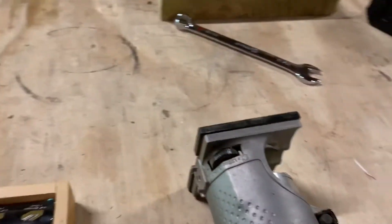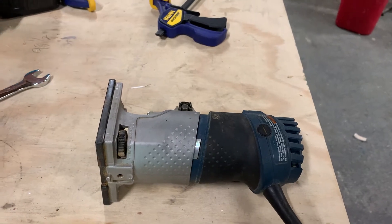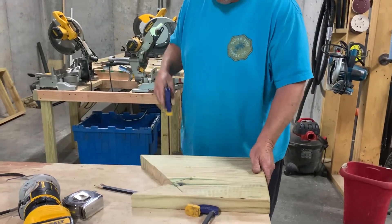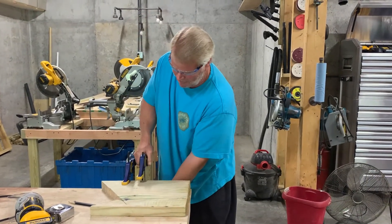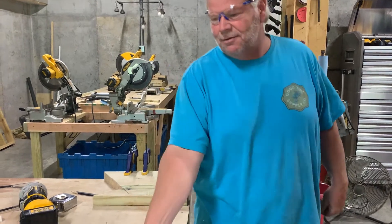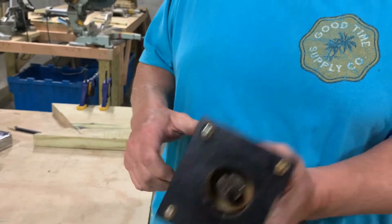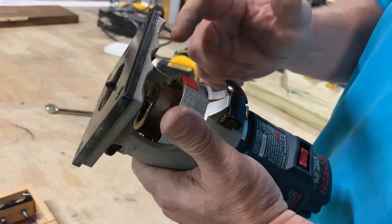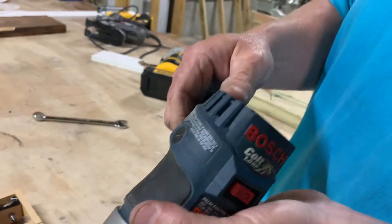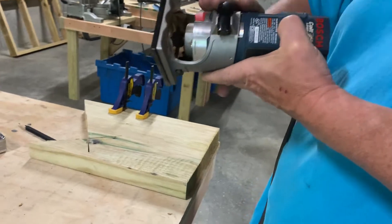Our other one is a corded one, and once again it's the same setup — a little insulated tool. I'm going to lock this down, just using some old scrap lumber here. This time I've got a different bit on it. This is a plunge bit, and it's used for — let's say you wanted to write something in a piece of wood, this is a great bit for that. I've set my depth at about a quarter inch. You do the same thing when locking it in — this is your lock to tighten up the bit. It's all set and ready to go. Your speed control on this particular one is up top, and we've got it on its max setting. So we're going to just try and draw something simple in this board.